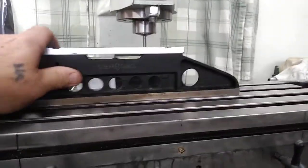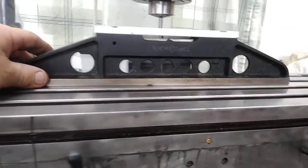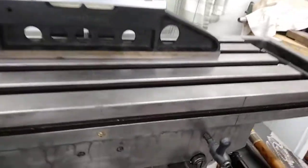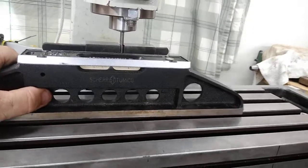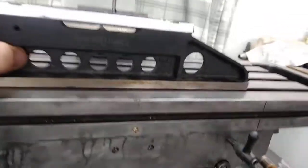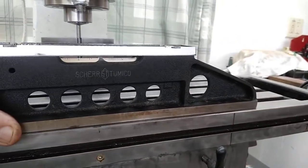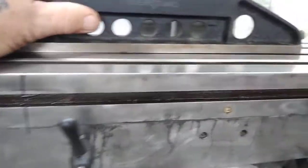I've already checked the flatness of this bed with dial indicators. This is a 15-inch German level that Mr. Lee loaned us and was kind enough to let me keep over the weekend, because once I pick this up I'll recheck the tramming. This thing is in super good shape — there is no wear on this even though it's a 2003 Rong Fu.